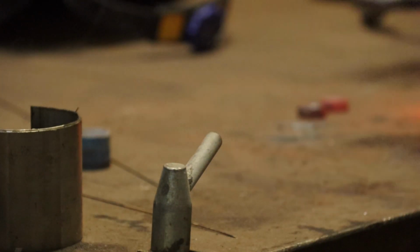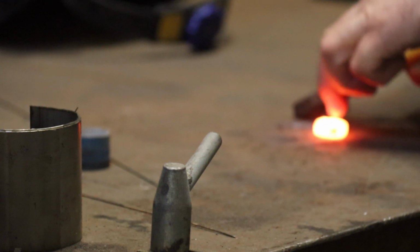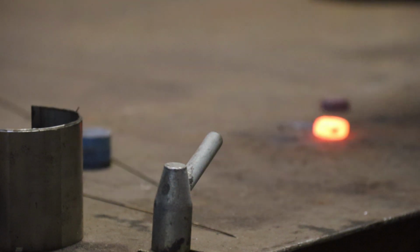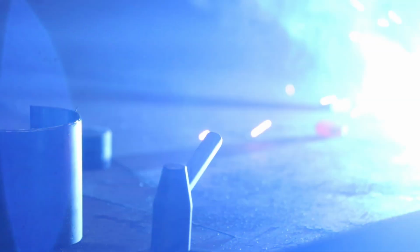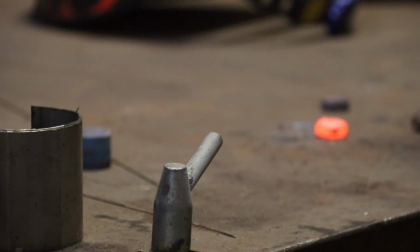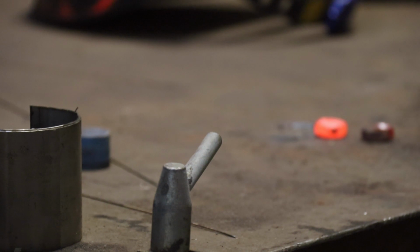I mean, this is completely solid metal in the middle. You'll see when we drill and tap it, just check we haven't got any flat spots to fill in. Just a bit there. Obviously I'll sand them flat first and then drill and tap them. That one's alright, that's fine. Cool. So we will come back when these have gone cold and on the lathe and I'll drill and tap them out for you.